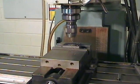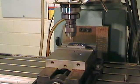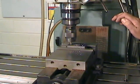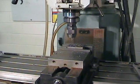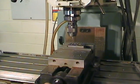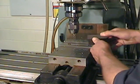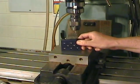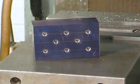Well, we did it for a safety backup, because edge finding operations, when not done correctly, usually have large mistakes. It's rarely out by just a bit. These laid out lines will help us to determine if our edge finding and setting up of our digital readout was done properly. You know the old saying, an ounce of prevention is worth a pound of cure. And there you go. Our 8 holes have been center drilled.